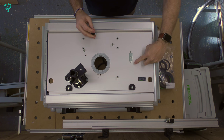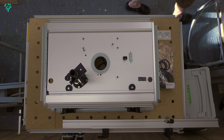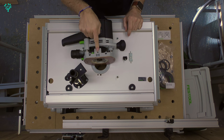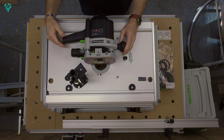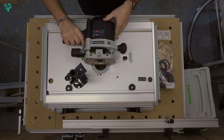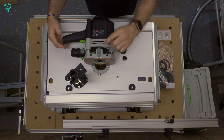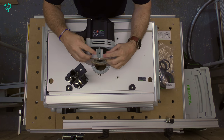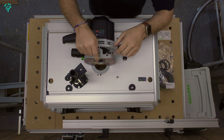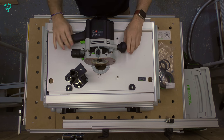Inside the kit, you also get this little metal bracket — it's got a thin lug on one end and a fat lug on the other end, and it comes with a small black knob. That's a locating pin, and it attaches to your router. Here's my 1400 router — it attaches to the same part of the router that the support foot on the LR32 fastened to. On the flat side of the router, you can't mistake it because there's nothing else this will attach to. What is important is to orientate this in the right direction: the thin end is for the OF-1010, and the fat end is for the OF-1400 and OF-2020. So the fat end needs to be facing down, toward the base of the router, and you simply secure that into position with that black lug.